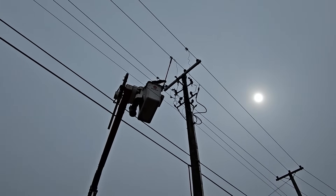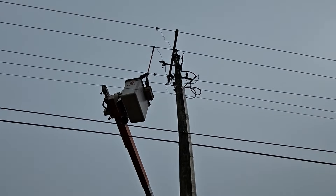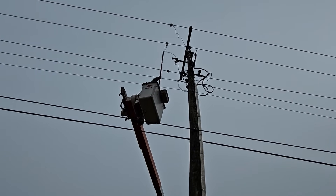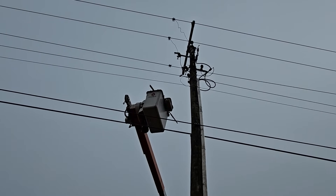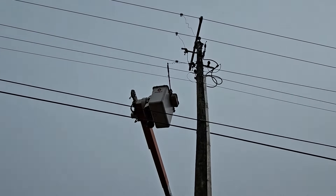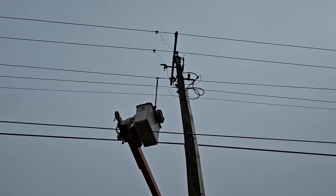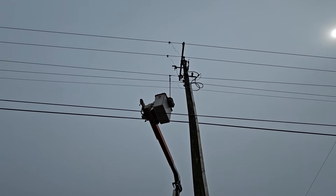While he's doing that, Ryan is going inside the building letting them know that we are tapping on the cables. I always say when doing a step as important as this, you always want to confirm that step twice - whenever it's cutting a live wire, paralleling, whatever. In this situation, we told the electricians to stay clear. We got outside, got the truck set up, tapped on after speaking with our dispatcher. Went back in the building again to confirm once again - not only is the electrical room clear, but there's also someone standing by to make sure none of the other workers go into that room.